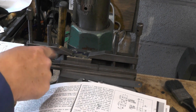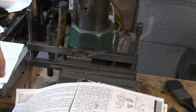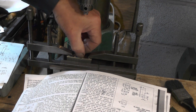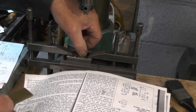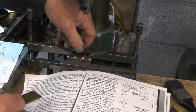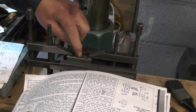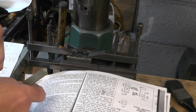So what I'm doing with these slide blocks — now I've milled the main slot in, the 3/8th slot — they have to have a cover plate on. Now in the write-up, in the book here, it tells you to put a cover plate 3/32nds thick on, but it also says maybe that might be difficult to obtain. If you can't get 3/32nds it says put 1/8th thick plate on, and then when you fasten this plate onto the slides with these countersunk screws, you take a skim across the top and bring it back to its size.